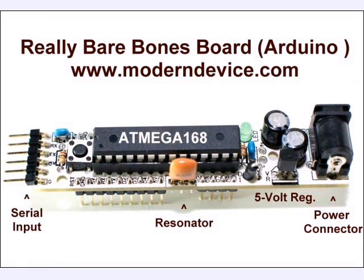All right, this is a device that I use quite a bit. It's the really bare bones board from a company called moderndevice.com. Looking this over, it's just a simple circuit board. Over here on your left, here is a connector that will connect to a separate serial to TTL converter. Here's our ATmega168 chip.